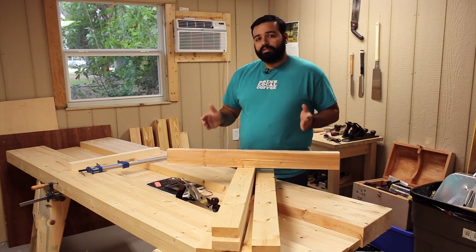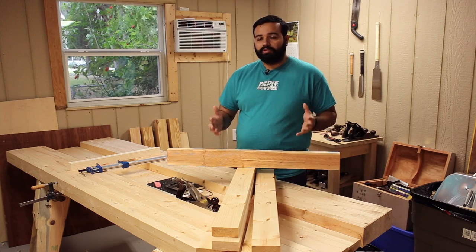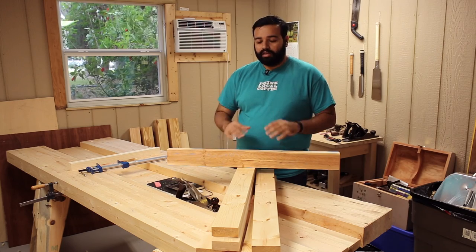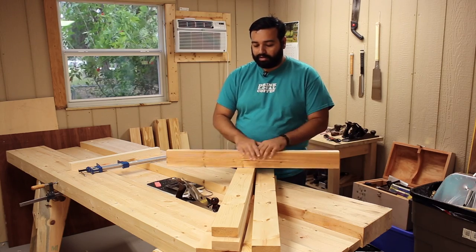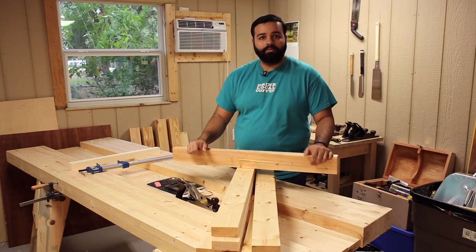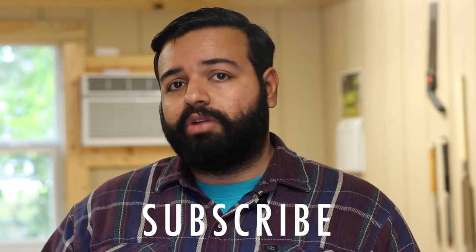If you are to build a Paul Sellers workbench or English joiners workbench or any workbench for that matter, spend your time selecting really good straight, flat, knot-free stock if you can. This construction grade 2x4 is not the funnest stock to work with but you get what you have — all of this is spruce and I tried to support a local lumber mill. That was a fun week preparing the stock. Truing those twisted boards was pretty challenging but they're done and I'm ready to do the joinery. Leave a comment below and let me know what kind of challenging project you have this week. New videos come out on Thursdays, so hit the subscribe button if you want to keep up with my channel. I hope you have a good week.